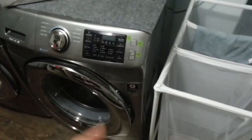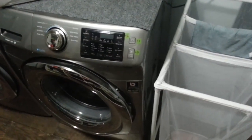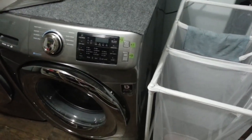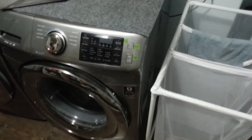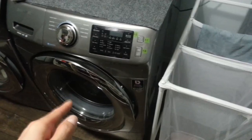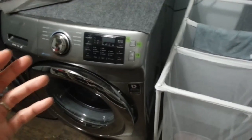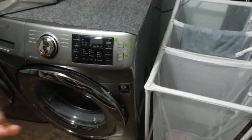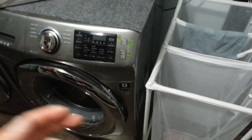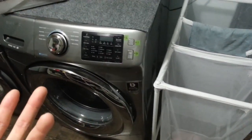So we wash our clothes at like 11 a.m. or noontime, when the sun's directly over the solar. That's when my solar panels would do about 900 watts. My air conditioner is using about 500 to 550 watts, and the washing machine is using about 100 to 400 watts, but the 400 watts only lasts maybe 10 to 15 minutes. So that's still within 900 watts. I'm still not using any battery power, just all solar. But I can do that only from about 12 to 2:30 or 3 o'clock.